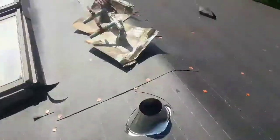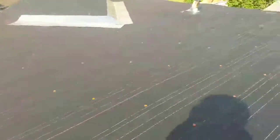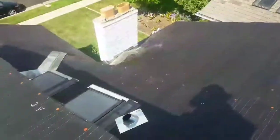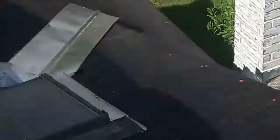Anyway, this is the top of the roof — you're gonna have tile later on. I think they're gonna tent the house before we install the tiles. I built a cricket around the fireplaces and I modified the counter flashing. I also built a cricket around the fireplace on the bottom side — see that? And then I put my counter flashing on top, so right here I'm missing one, two...